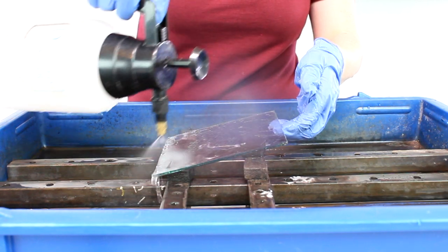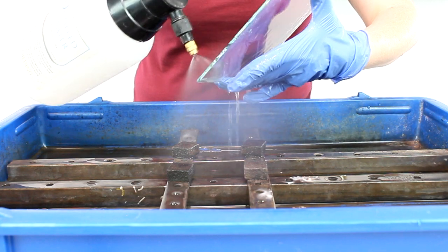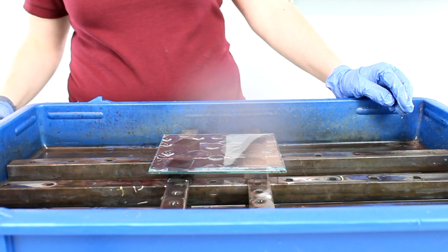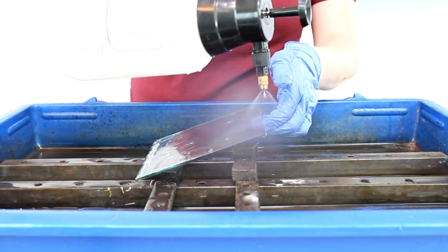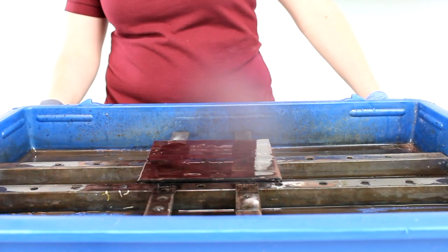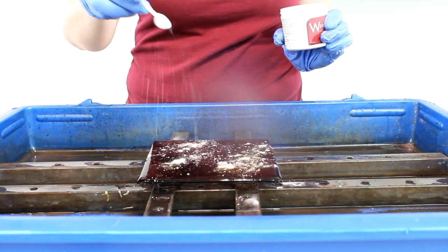Now we're going to go straight on to our second process with another piece. We're using whiting in a slightly different way, but starting with our rinse of distilled water. We're going to tin the surface as we did before with the regular tin for silver, rocking the glass and allowing that to deposit for 30 seconds. Once that tin has deposited, we rinse it off really well with distilled water, making sure any excess tin is off. Here we've poured on our pouring silver chemicals, rocking it gently for 30 seconds, and then we're going to go in with the whiting. So you can see the glass is already darkened, the silver is starting to act, and the whiting is being sprinkled on top.